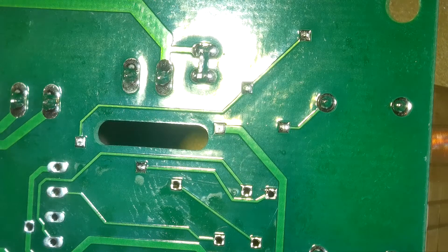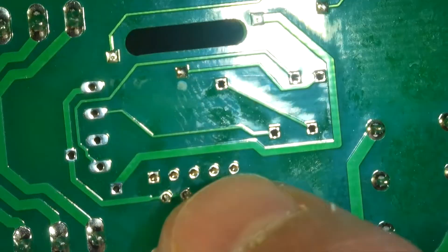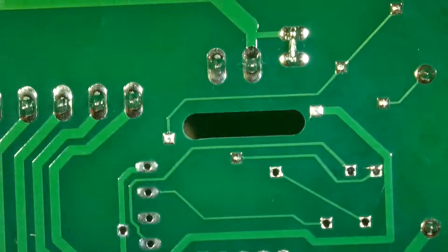Occasionally there's a bridge in dip soldering, and that's why I don't dip solder these tiny pitch things, because it bridges quite a bit.